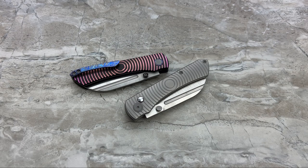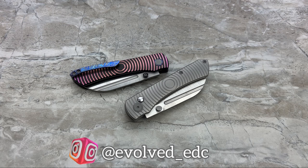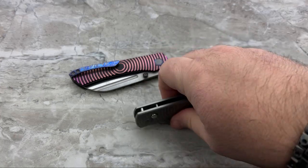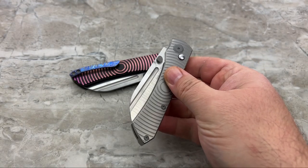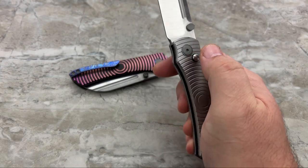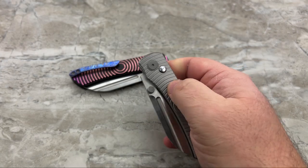Tyler is using Best Tech for his OEM and Best Tech has never made a button lock before. And if you were to pick up the prototypes I have sitting here, you would go, yeah, that's kind of evident because the spring strength in the plunge in the button lock is really, really weak.